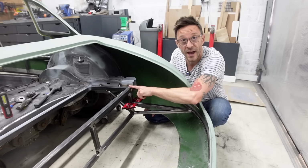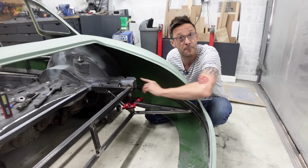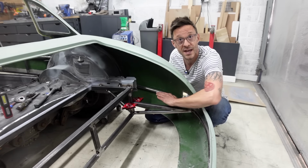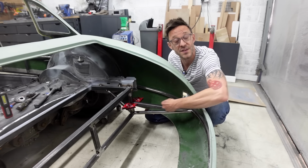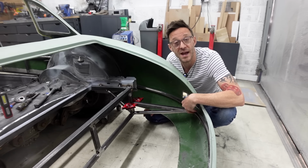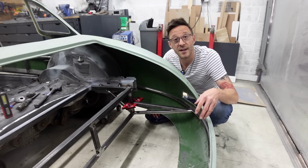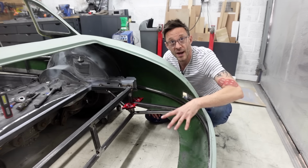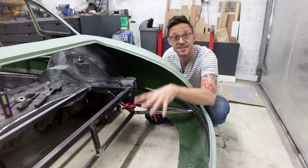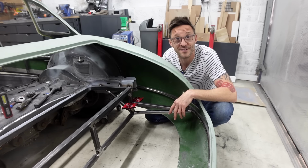Although for a true sort of belt and braces approach, I would have taken that up to the top of the petrol tank framing. But because I wanted to use this to set this boot floor level, this is why it's at the level it is. It's all been cut and bird's mouthed and ready to weld in. So after these are in, I can then start looking at the additional bracing that I'm going to incorporate into the center of the boot. So let's get these welded in and then we can move on to the other bits.